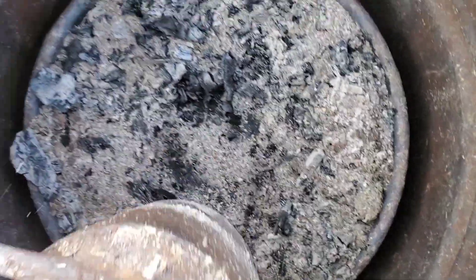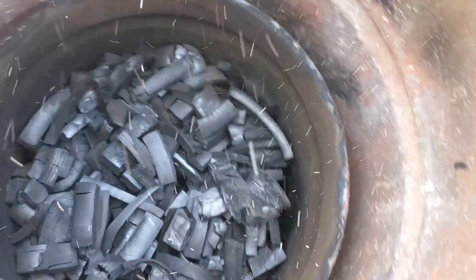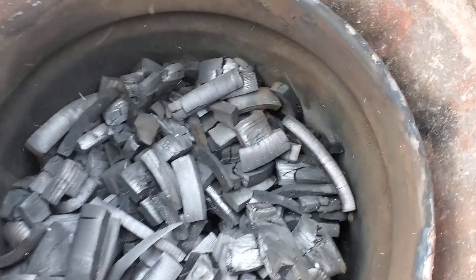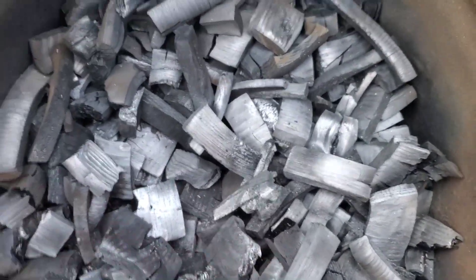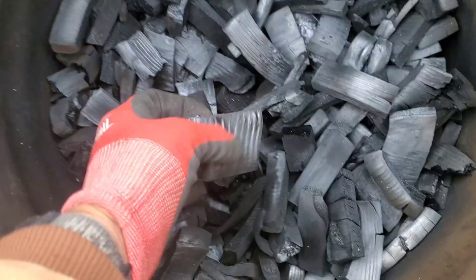It's the following morning — let's take a look inside and see how that last batch ran. One thing particularly noteworthy: look at the inside of the inner walls of this barrel. There's not a lot of residual creosote buildup, just residual carbon. By contrast, my experience with this retort burning wood chips — even when completely dry — I wind up with a much slower burn, leaving residual creosote on the inside of the inner wall. If you see ways I can improve my system to make it more efficient, leave a comment. Please consider subscribing. Thanks for watching, and go out and make some char.